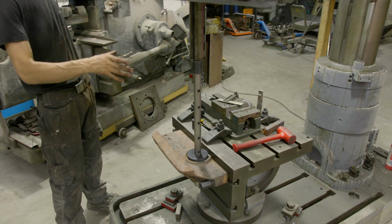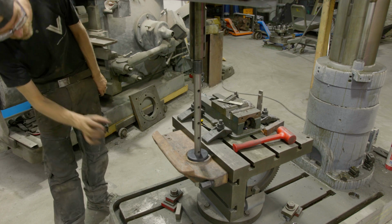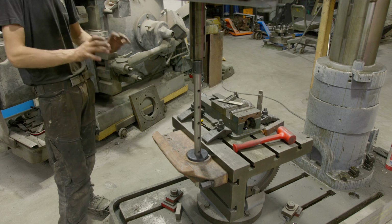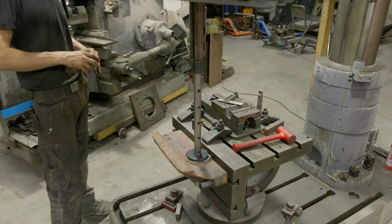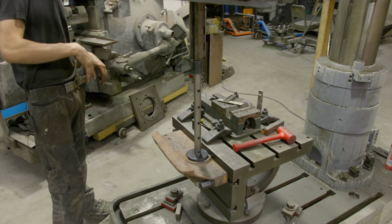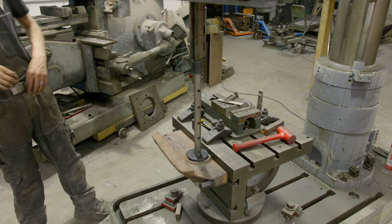We're not going to do a bearing support on the top because we have our quill and it's a real short bore. So what I'm going to do now is take a bearing support and place it on the back and fab up a quick mount and secure it. And we'll use that for all of them. And then we'll just use this plug to center all of these up, and that's going to be more efficient than using the cones, and it drops down and registers on the bore with a decent fit, so that'll be perfect. So let me get that set up and we'll come back.